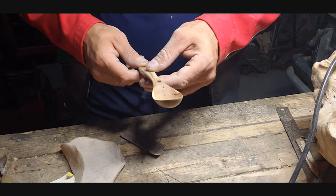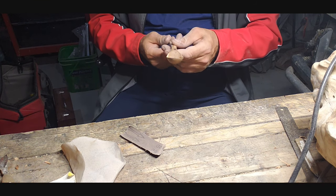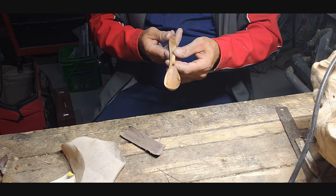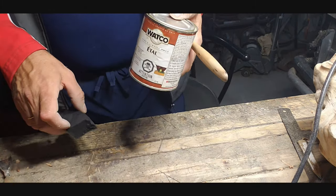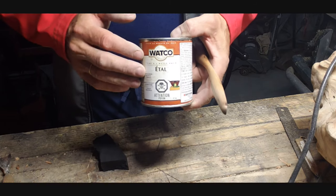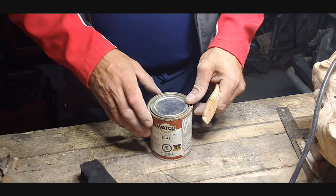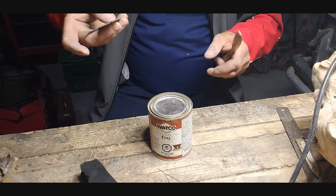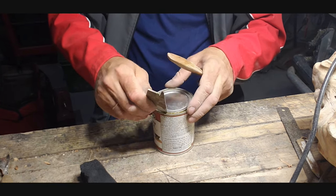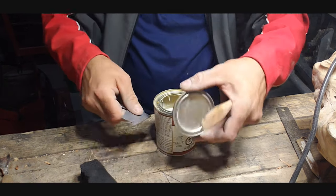Okay, thank you for watching. Actually, no. We're going to do butcher block oil on it. I just really want to see how it's going to come out applying butcher block oil. Okay, this is what I use, and I like it, I'm happy with it. It takes time to dry, it's not going to be as quick as varnish, but like I said, the best part of it, it's food safe, you wouldn't be worried about using the spoon, and it's stabilizing your wood.